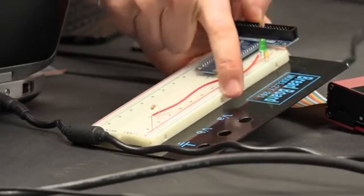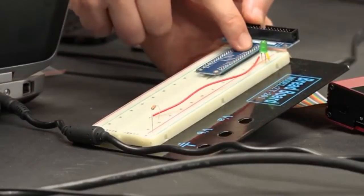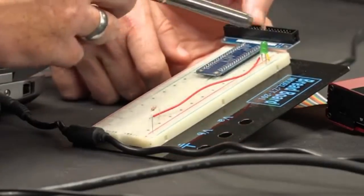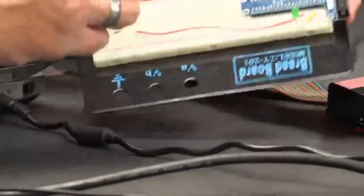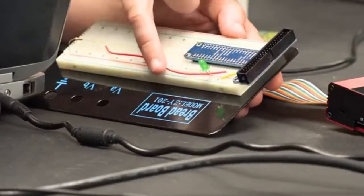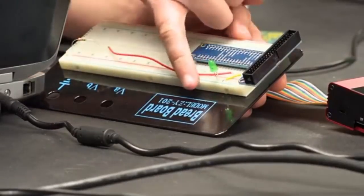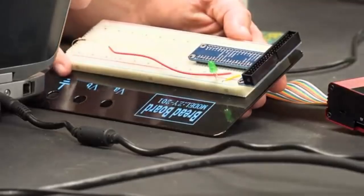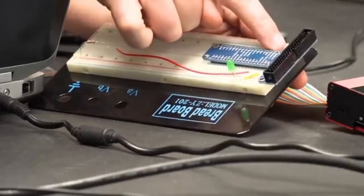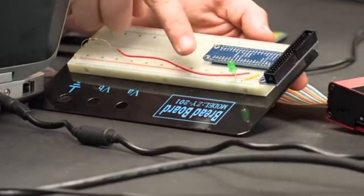So anything that I plug into the blue, see that blue stripe? Anything I plug into that will be connected to the ground on the Raspberry Pi once this is plugged into the GPIO. So then the yellow cable just up here is plugged in there because it's on the same horizontal line as the ground. You couldn't just throw it anywhere down the line, correct? You could, as long as it's touching a contact, because as long as it touches a contact in the negative line, it will basically connect to all of the holes in this line. Okay, makes sense. On the right-hand side and the left-hand side, where it says positive and negative, it's like that. But this is basically two separate sides, so I'm working all on the right-hand side of my board.